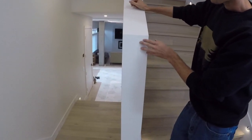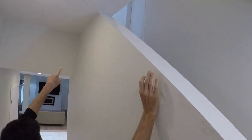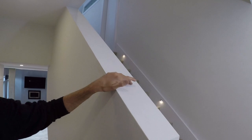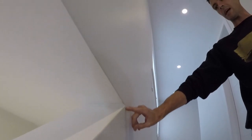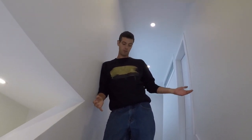These parts were built up so much — it's not cracked after smacking on it. We had this other spot back here where I put some mesh tape — it hasn't cracked. This flange here hasn't cracked — it's solid. These horrible joints up here that are like three-eighths of an inch thick look and feel totally flat. I can't see the hump in the wall at all. The spot where I put tape across where the beads join — no crack. So it's solid. A lot of months later and I expect it to look good for a long time still.